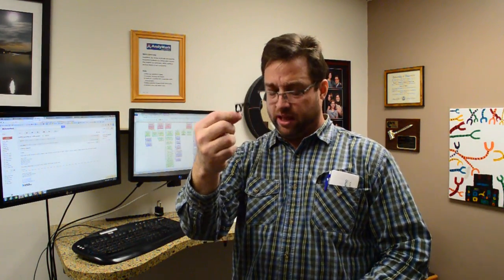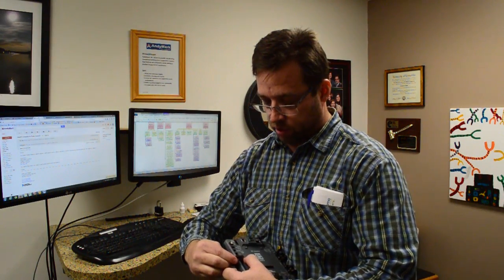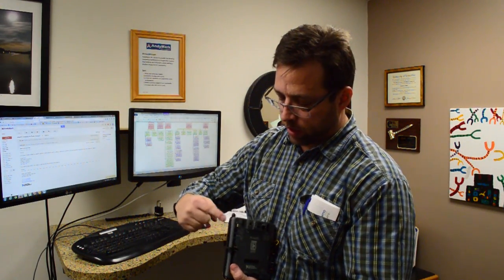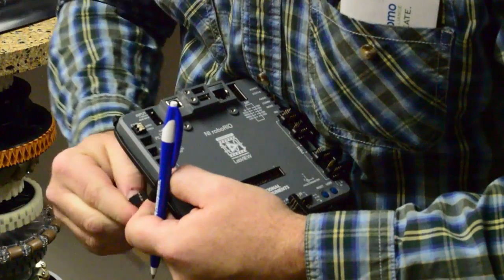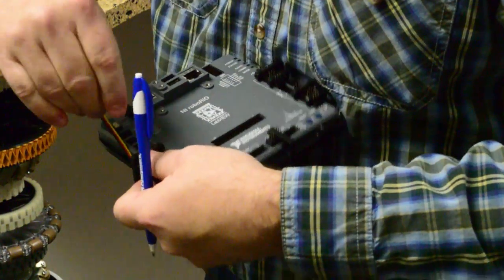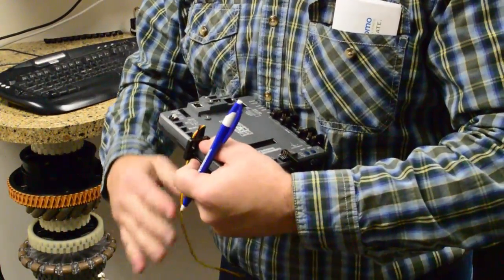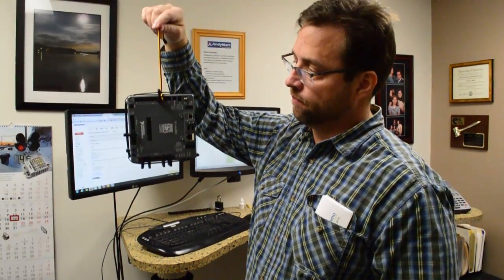It's a little plastic clip that goes over these pin savers, which are just pass-through connectors. To get it to stay, you zip tie first and then flip it, so you have a zip tie going through the holes already in the RoboRIO. Clip the back to the zip tie, the front holds the header in. You can add a PWM cable, push it up through the zip tie — ground nearest to the outside — and now you've got a strain relief for your PWM.